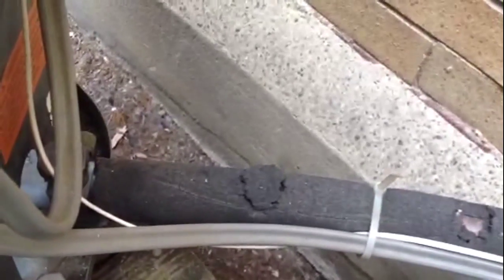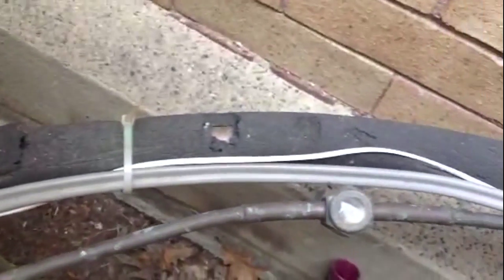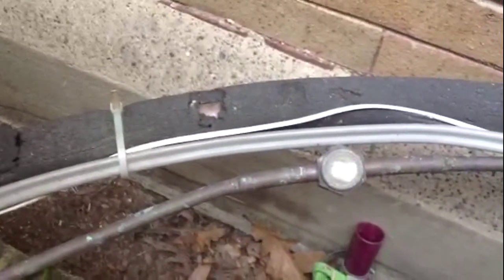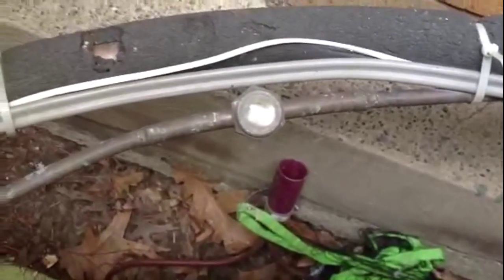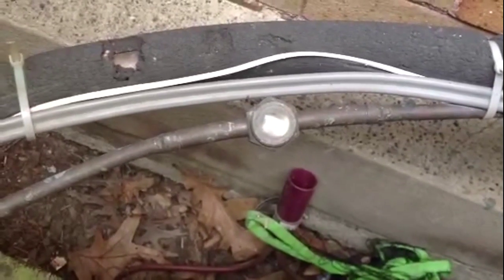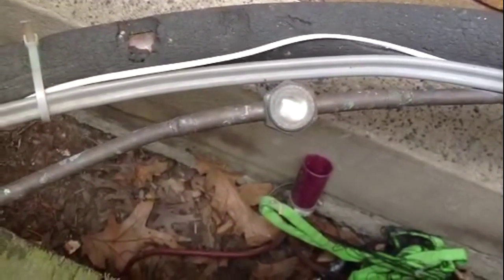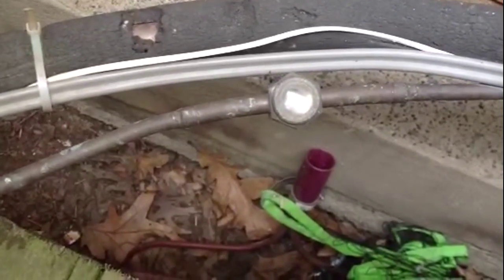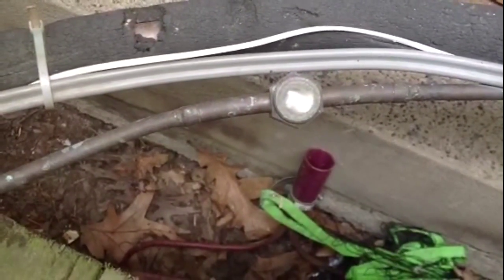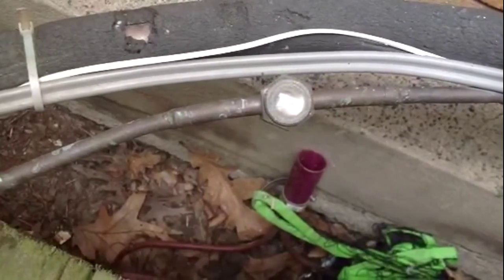It's a good way to know if you're low — either by reading your sight glass or looking at your suction line. Also, on your sight glass, when your air conditioner is fired up, you should actually see the refrigerant in the sight glass go bubbly, and then it will clear out. That's exactly how a full charge air conditioner should appear.